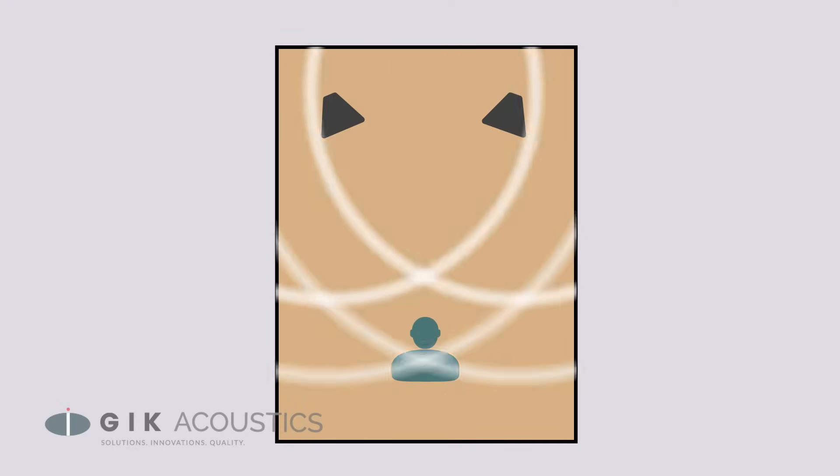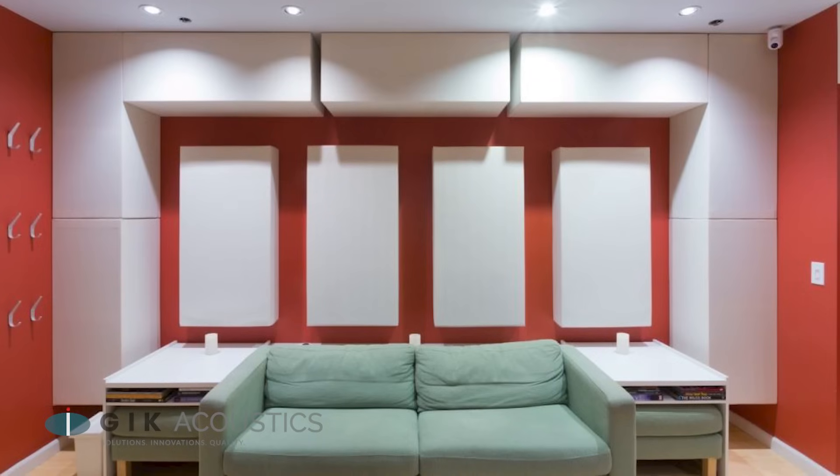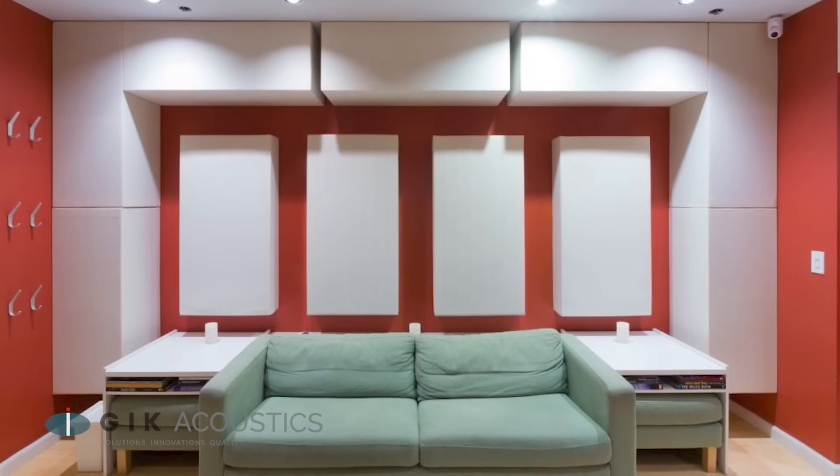The back wall is another key area you'll want to focus treatment. By definition, the back wall will be the wall that your speakers are directed towards, so there's a lot of energy reflecting off the back wall that can contribute to things like room modes and reverb. This is an area where you'll also want to focus thick bass traps. The full range of your speakers will reflect off the back wall, so broadband panels like the full range 244s or Monsters are a great choice, especially when you have a lot of doors or windows that limit the ability to cover a good percentage of the back wall. In these cases, we're taking advantage of the limited space we have to remove as much of the total reflections as possible. But when you can cover 30–40% of your entire rear wall or more, diffusion is a great way to control the return of your speaker's reflection in a more nuanced way.